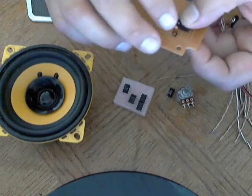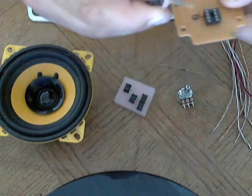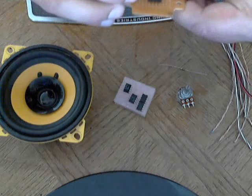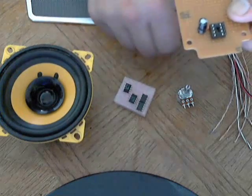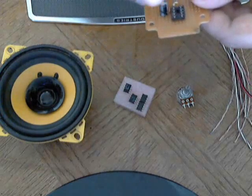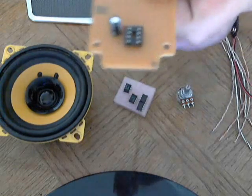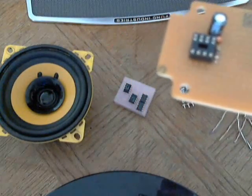Pin 5 comes out and you've got to get your smaller capacitor on there. These are just outlines I've made so you can see what you're doing. This is the bigger capacitor, and your resistor goes right there. As you can see, this doesn't take up a lot of room. I've had it small enough to fit in an Altoids container with a speaker and a battery. That is pretty much the minimal size of the circuit, and these are all the components you're going to have on the board.